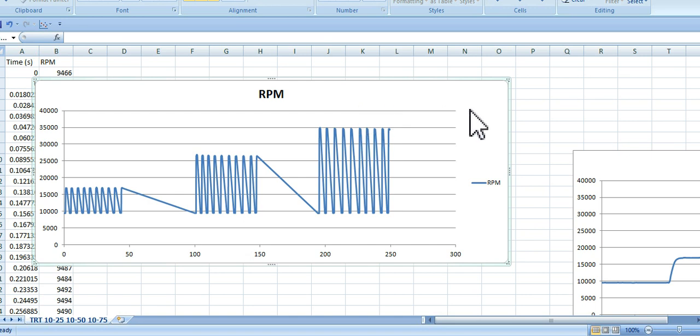results. But this data, this is where I think Carl Pablo's bringing some really new data into the micro world, because we haven't seen this, at least I haven't seen this kind of stuff out there yet. We've seen the static stuff, efficiency and thrust, but what we also want to know is not just how well the motor does when it's at a certain throttle point. We want to know how quickly it gets to that throttle point, and we also want to know when the PID controller is trying to adjust the throttle on the motor, how well is that motor going to respond to the PID controller, and therefore how well is it going to handle.